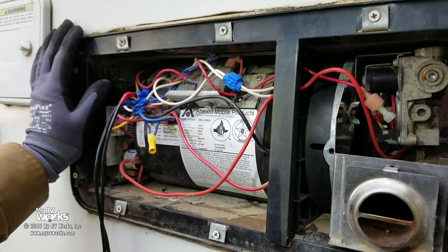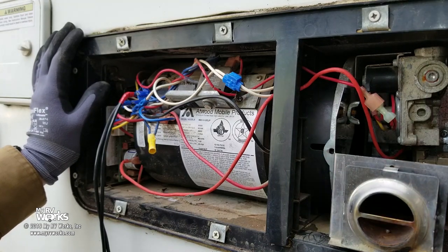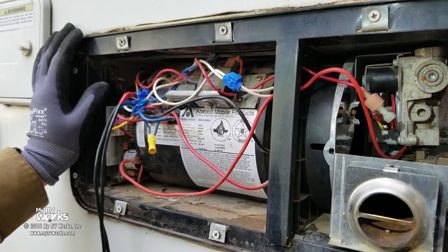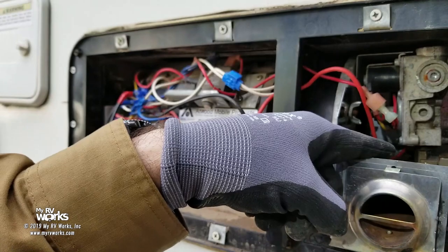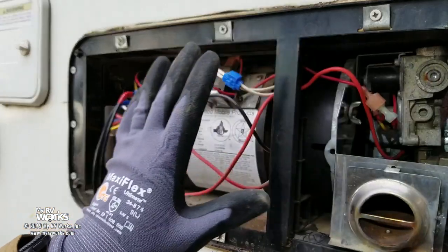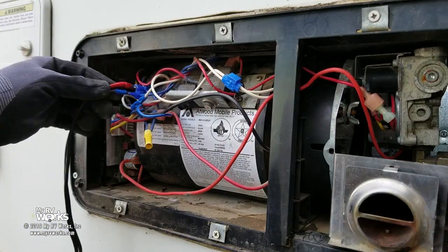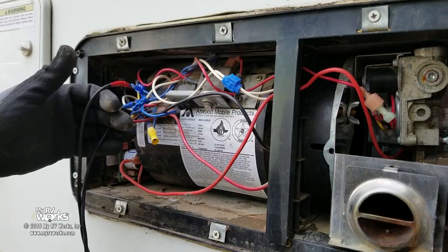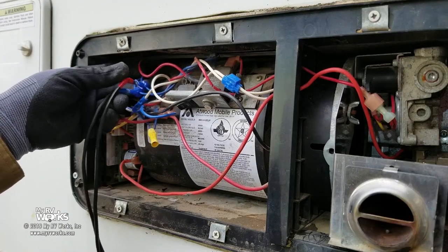If you've watched one of my other videos, there was a furnace issue where the burner head was rusted and had some cracks on it. This is, in fact, that furnace. The parts have come in. When I finished that video, I just kind of made it work in a bind. Now the motor's burned down too. So we've got three parts: the new burner head, a new electrode because the other one was rusted, and a new motor. I want you to hear that motor to verify — sure enough, that's definitely the problem.